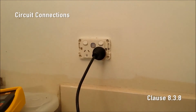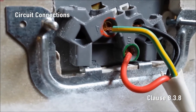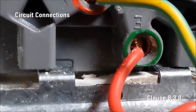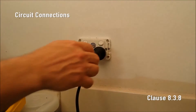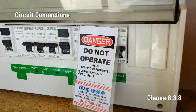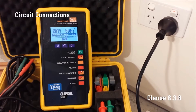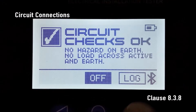Correct circuit connections. Here we must importantly check that the earthing system is not energized. If there is a short circuit or certain wiring transpositions, voltage will be present on the protective earthing conductor. SparkyMate detects this dangerous condition and displays either 'Danger: voltage on earth' or 'Danger: voltage on E or N'. Interconnection of conductors between different circuits can be checked by turning off the associated circuit breaker for the sub circuit under test and checking that SparkyMate displays 'No mains connected'. After a full check and any faults rectified, press circuit connections and you'll see 'Circuit checks OK'.